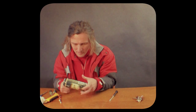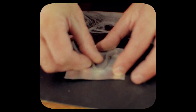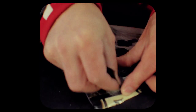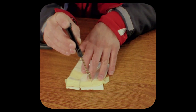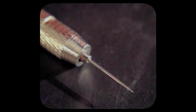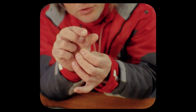The thin hole we will make in a thin sheet of tin. We can cut it out of a cola can or some other beverage can. First I take off the paint and thin coating with polishing paper from the part of the sheet where the hole will be. We will drill the hole with a sewing needle — it's better to drill than to pierce the hole, so the sheet will not be deformed. For drilling we need a hand drill with a very small cartridge where we can clamp the needle as the drill. To have the needle clamped without backlash, it is necessary to break off its head as it usually has a broadening — this can be done more easily with pliers.